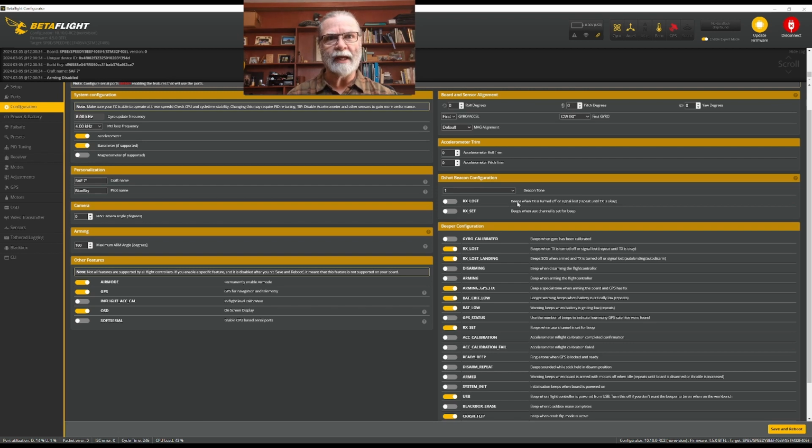The D-shot beacon, that is a beep that can be made by the motors in the case of a lost model, or if you set up a switch on your transmitter to activate the beeper. This is a feature that's only available with D-shot, and realistically, it works quite well if you have bigger motors, but it's hard on the motors, especially if you're doing it repeatedly or for a long period. It can actually cause the motors to overheat and be damaged.